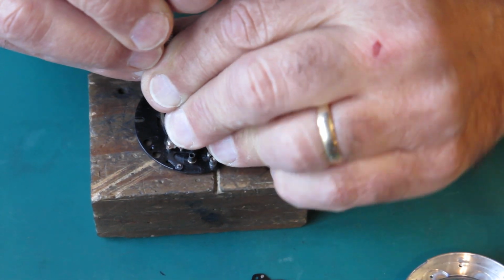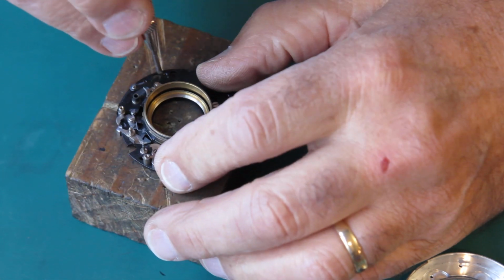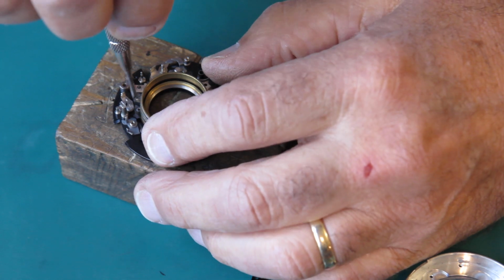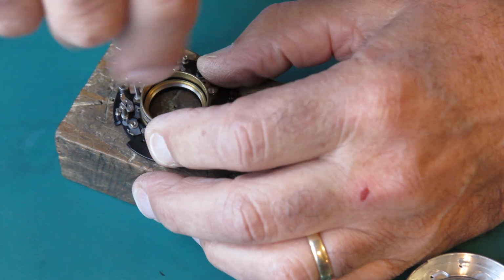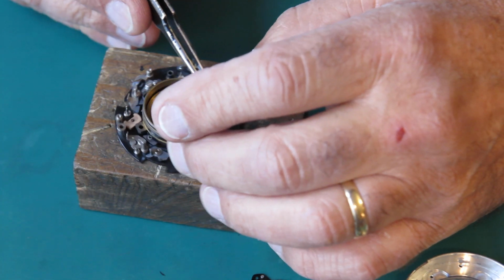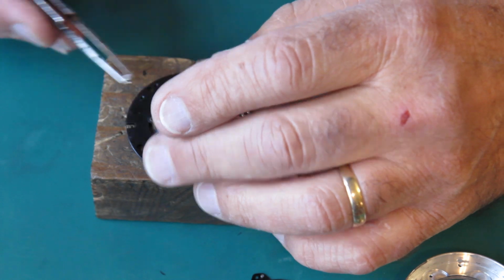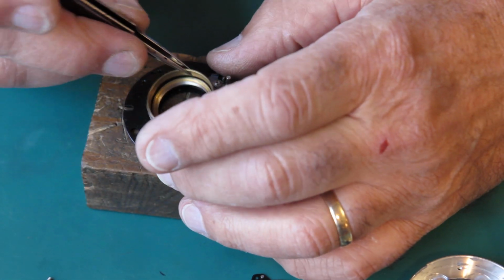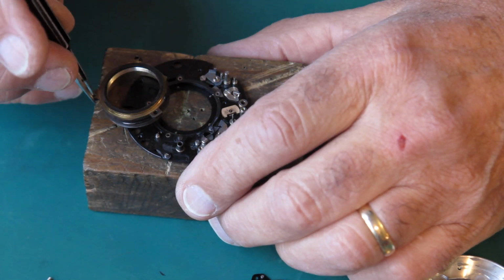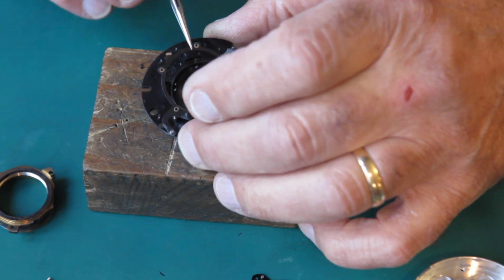If they were showing, these 3 screws hold the lens tube onto the mechanism plate, and like the case screws at the back, that was very tight. It's certainly useful to have screws reasonably tight so that they don't rattle loose over time, but there's an obvious limit. The screws are very small, they strip out relatively easily, and it's a nuisance if they do. You're not getting a helicoil for threads that size, so you don't want to strip them out. So I'll take this apart.